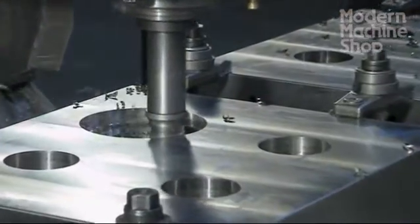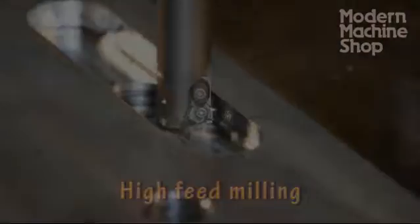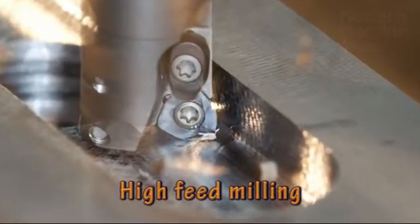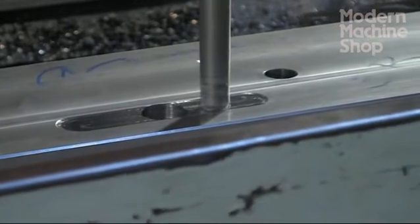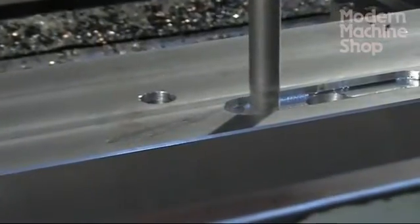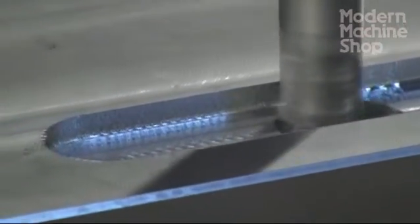Additional material is efficiently milled using a continuous helical path. Here we see high feed milling. This method uses radial feed, still leveraging vertical force to maximize productivity. This 1 inch diameter insert cutter is turning at 2500 RPM, feeding at 80 inches per minute. The step down is only 20 thousandths of an inch. The chip load per tooth is 16 thousandths of an inch.